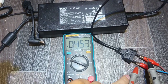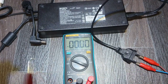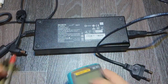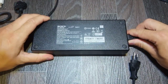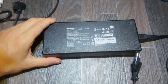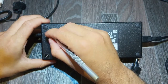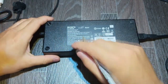But it's definitely not 19 volts. On the input I have 250V. I use an isolation transformer — of course, for safety you should do this too, because it's really dangerous to connect it directly from mains. You should not do this. Okay, here are some plugs — we are removing them.